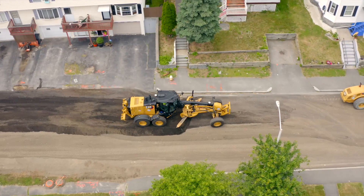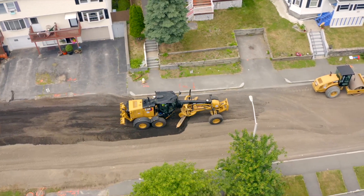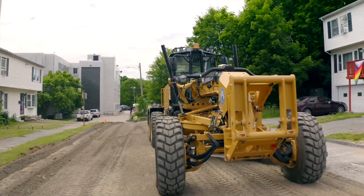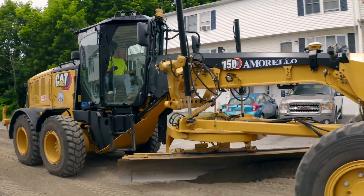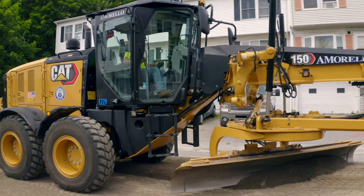This new 150 precision is so much tighter. I've been running this for two years and pretty much on most jobs I'm within a quarter of an inch of grade everywhere. My survey guy checks with a robot and he's very amazed at how tight this machine is. The biggest thing is the quality for the customer — when you're grading off a model, you're just not getting puddles. The customer is getting a higher level of work, saving time and money and fuel, and what we're leaving behind is a lot better today.